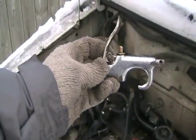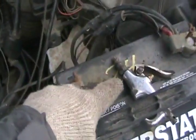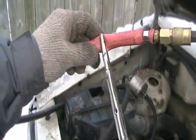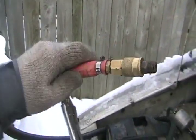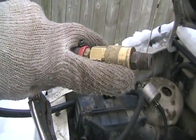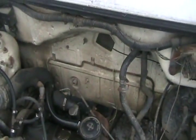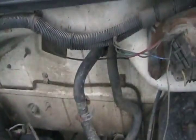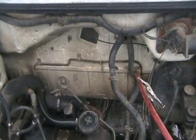If you've got compressed air, you're going to think about using one of those blow gun tips — don't. They don't have a fast enough rate of flow because of the tiny orifice inside to be effective. Get your air line and put a needle-nose vise grip on there and pinch it off. Then get a spare air chuck nipple or take it off your blower and connect it in there — no air will come out because it's pinched. Wrap electrical tape around those threads until it becomes the same size as the inside diameter of the hose you're working with. Now that it's the same size as the hole, shove it in the pipe which is the formerly-output — now that's going to be your input. Put a hose clamp around the piece of rubber hose you added or that you left on, so the contents aren't going to spray you in the face.